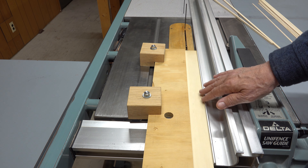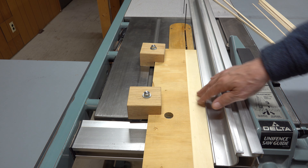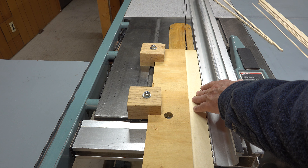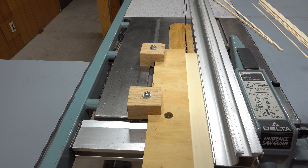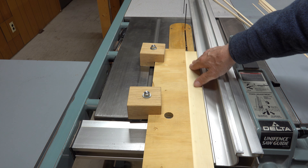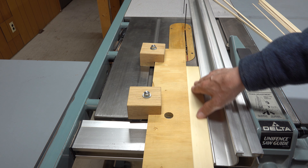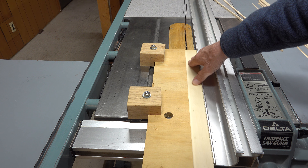When you're done doing that, you'll find this is too tight and you can't move it. That's okay. Loosen up your fence, move it away, bring it back just till it fits perfectly — no drag, just lightly. You want to make sure there's no real bad friction in there at all, or all of a sudden it's gonna shoot forward and be dangerous. Just the lightest amount of tension is fine.